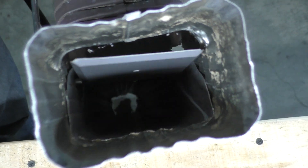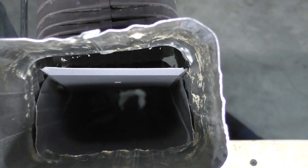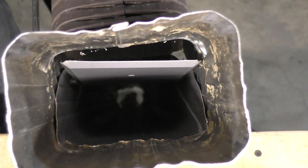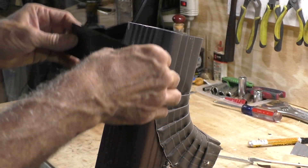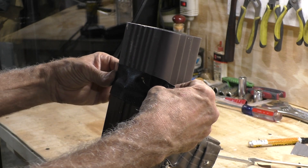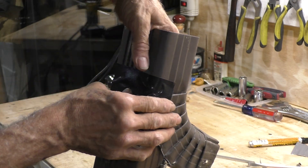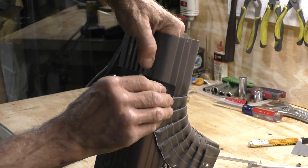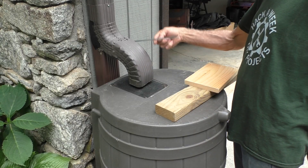After a bunch of cutting and fitting, I've got this pretty well worked out. It all slides in there like that. There's going to be a piece of flashing basically — I'll bend that up, let it poke inside here, bend it back flat. That will anchor it all together in place. On the other end, that bent-up piece will get flattened out, which will seal this off back here. Our flap will do the job of diverting the water. I've opted for Gorilla Tape instead of screws — I can't have any screws poking through because they'll hinder the movement of the flapper. So just good old Gorilla Tape. I have a working flapper valve installed.